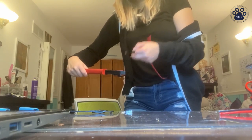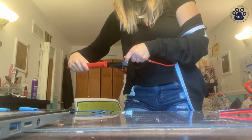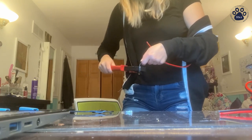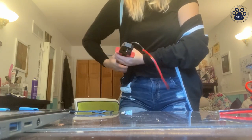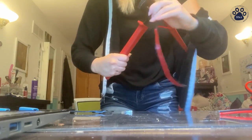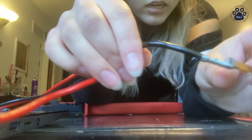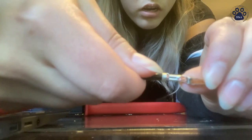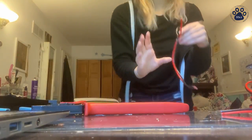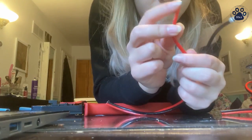Hold it like this against you so you can hold the wire and the crimper at the same time. Make sure it's twisted well, and place it in there all the way so that the coating is in. Then you can take a look at the connection — make sure you've got a little bit of coating in there — and then pull. That's how you crimp. You'll do the same exact thing for the other one.